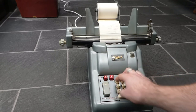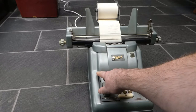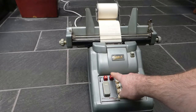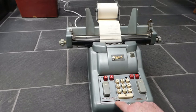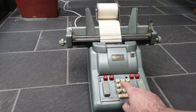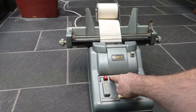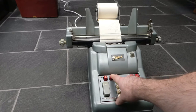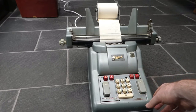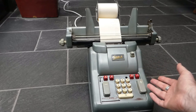This small lever here is the so-called step-o-matic. In the down position it does nothing, but in the upper position, when you release the repeated-addition button, it automatically enters a zero, shifting the input to the left. That means you can do multiplications more easily. You could enter a number, hold this down for two cycles, and it would automatically shift to the left so that you can then add it again in the tens position. If you then held it down for three cycles, you would have multiplied it by 32.